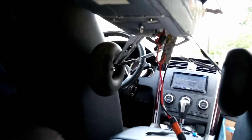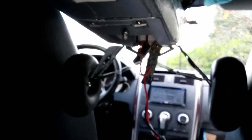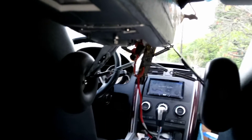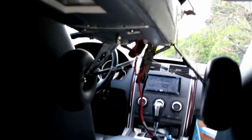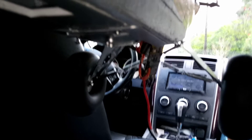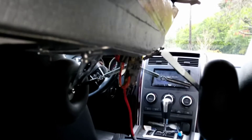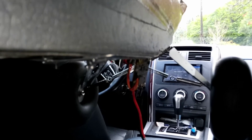My theory: if the problem with not being able to power up is a wet ESC — as it was on my Maul — then I've got it unwrapped and I'm exposing it to warm but not hot air, a lot of it, fast, coming from a fan. My theory was get this thing dried out fully and maybe we'll be back in business. Well, we are back in business. She's powering up again now.